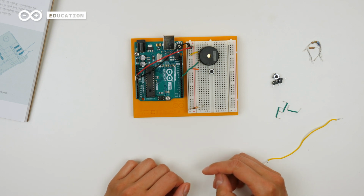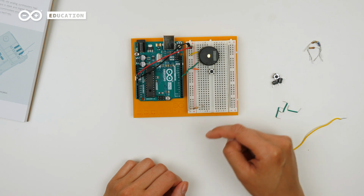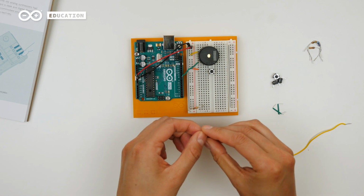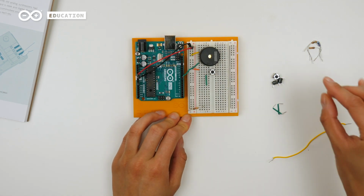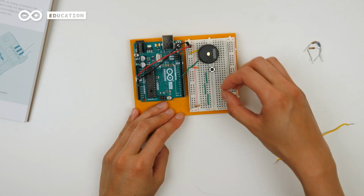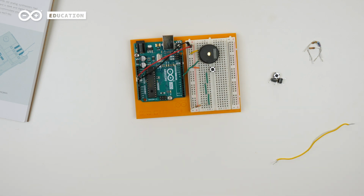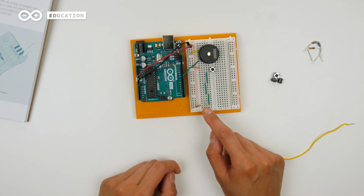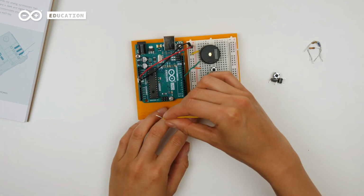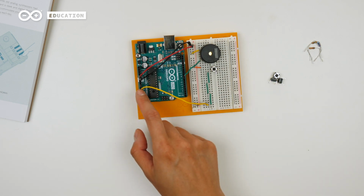But instead of having one long wire from the leg to the resistor, I'm going to split it into 3 smaller wires. This is so that I can connect the other switches and resistors to those rows later. I've found that this wire length is good for this, and I'm placing down these rows here like this. Now I can also connect other components to the circuit through these rows. I will connect analog pin 0 here so that we can read the voltage from the circuit. If I press this switch when everything is connected, this pin should read 5 volts.